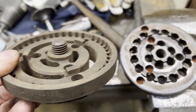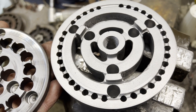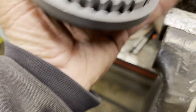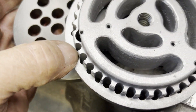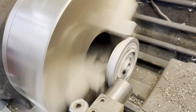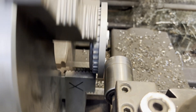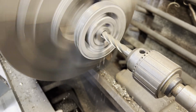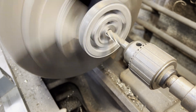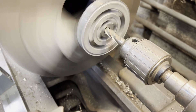I'm going to take this one and make one of these — a fun little project. On this particular Gardner Denver valve guard, it is extremely hard. The spring that was running in the pocket for 20 years was harder, so I decided to take another old guard and basically machine and modify it to make it work. We could have hunted one down and ordered it, but when we lose our shop air it slows down a lot of production, so sometimes it's just easier to build something and get it back up and running.